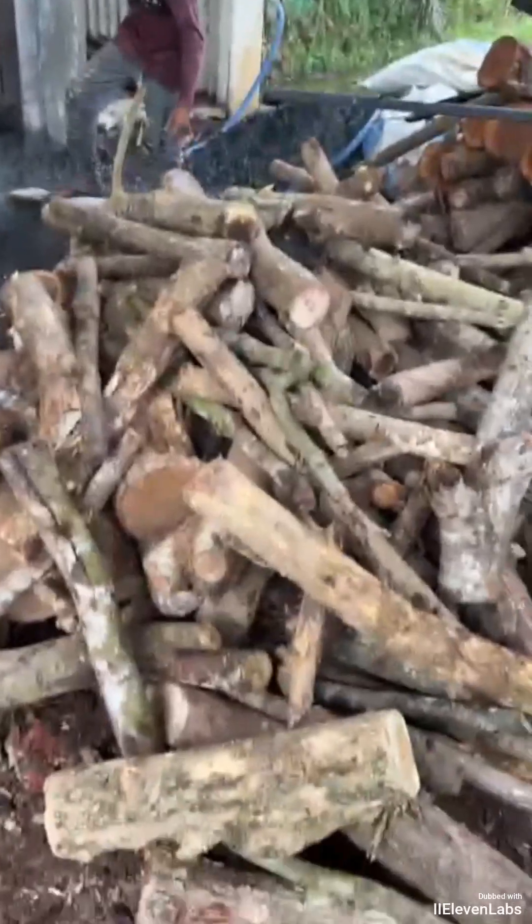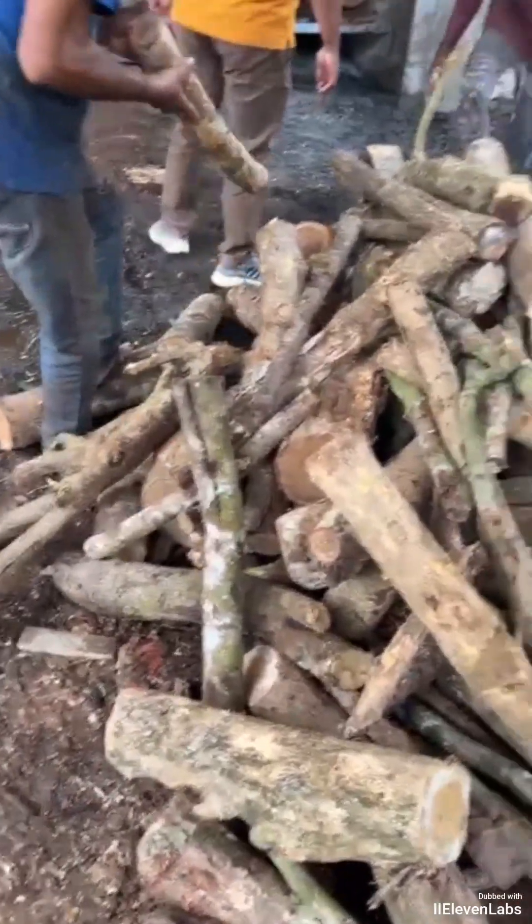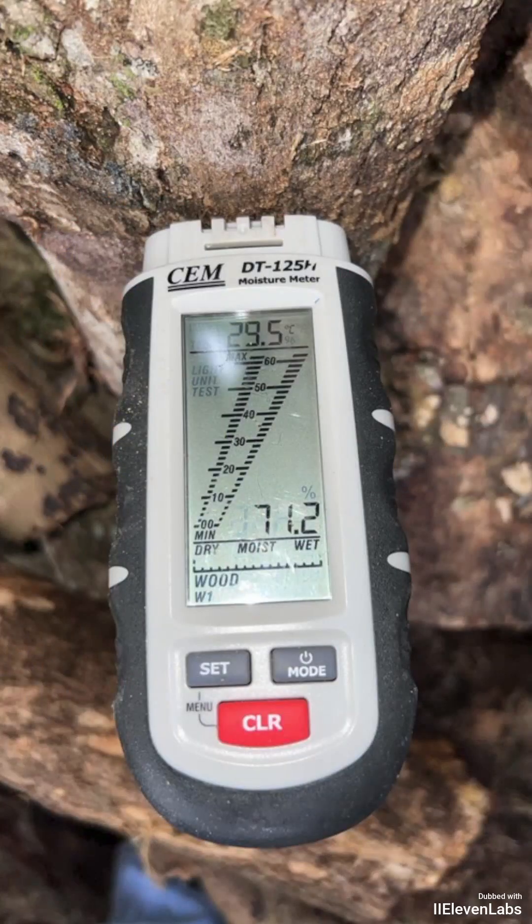The thing is, they used to heat with wet wood chips before, which caused insane overconsumption. Rice husk is practically free fuel. These wet wood chips can have moisture levels up to 71%, and at such moisture levels the overconsumption is simply double or triple. Rice husk is basically waste — it's an environmental disaster there. There's a lot of it and it costs nothing.